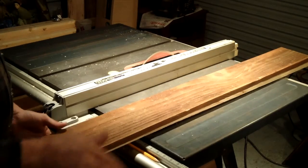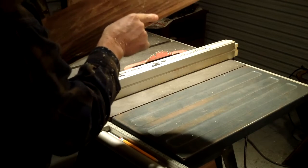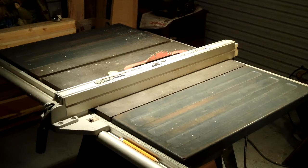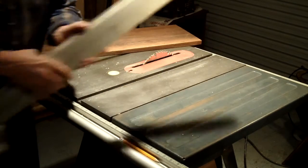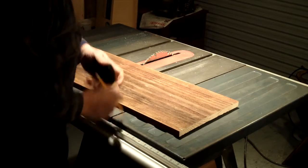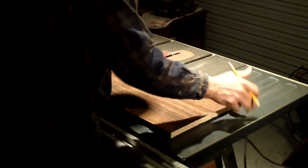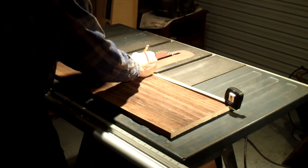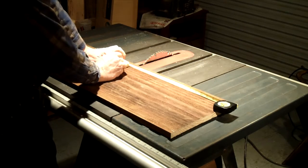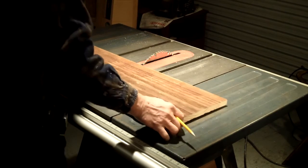Two aprons. We're still gonna need to make a diagonal cut into each one of these aprons, and I'll show you how to do that here in a bit. Now we're gonna split the 36 inch board. See, that's 36 and then 18. The final height of these boards is not going to be 18. Going to be around 17 1/4, because remember your top's going to be 3/4 inch, and you add that to 17 1/4, brings it to an 18 inch height. That little bit of extra gives me something to square this up to the true edge, a little to work with.